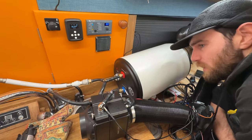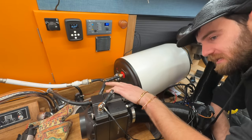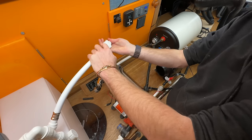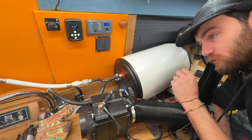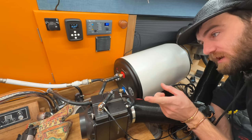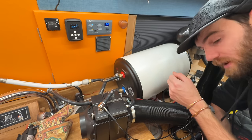Not all my testing went well. Because it was unpressurized I chose not to use some of the retaining clips, but I did put a valve on the end of the output to simulate a closed tap. Unfortunately, twice I forgot to open a valve before pressurizing to 40 psi, which blew the pump pipe into my face. My cameras weren't running but here's the aftermath.